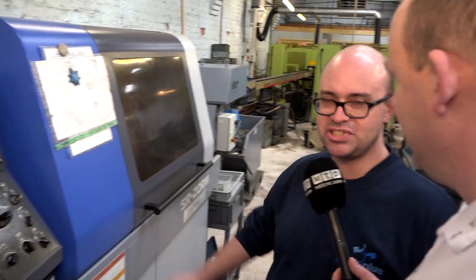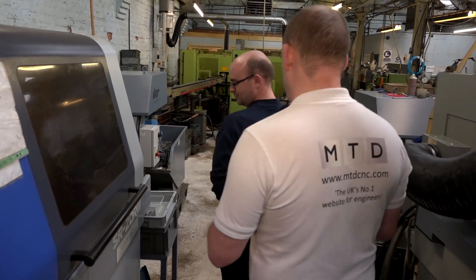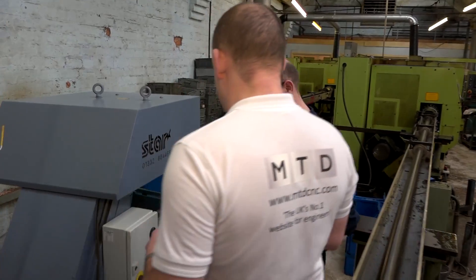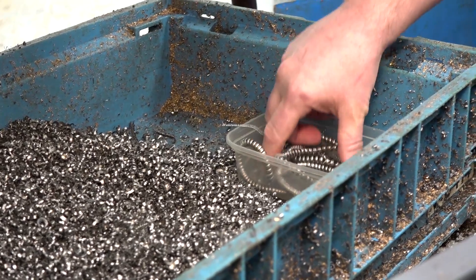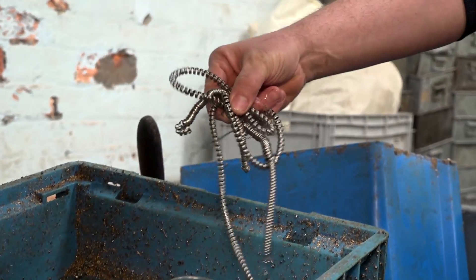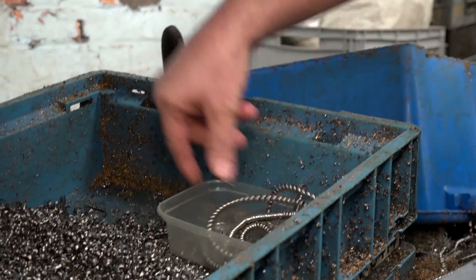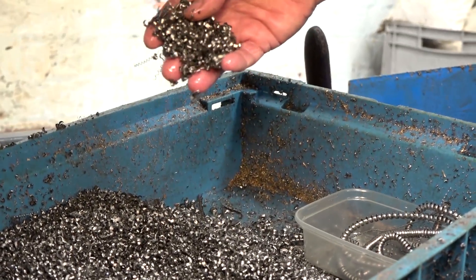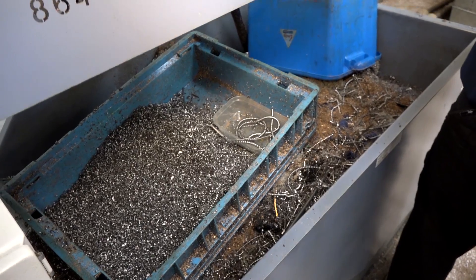Especially on this one, which is our oldest Star machine. We bought this one new in June 2007. Now let's have a look at some examples of the swarf and the differences here, because this is really what you want to see. This is 316 stainless — this is an example without the HFT on, and this is running full production with HFT on. As you can see, all the chips are easily manageable, being collected in the bin and getting ready for recycling.